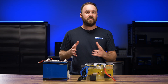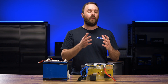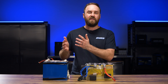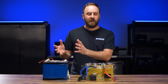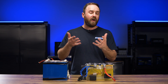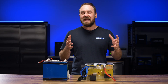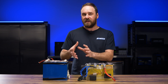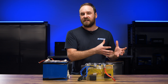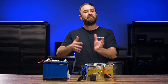Grade B batteries might come from the same batch as grade A batteries, but they don't adhere to those physical or performance specifications. So let's say it was a 100 amp hour cell that was only able to output 95 amp hours — it would then go into the grade B class. Now there's nothing wrong with a grade B battery in itself, so long as you're aware that it is a grade B battery and you're happy that it may not be the full correct specifications of the grade A equivalent. Where it gets hazy is that you see some suppliers or sellers claiming grade A secondhand cells, and that can't strictly be true because it's very unlikely that a secondhand cell would pass those strict specification requirements. It might have been grade A when manufactured, but it definitely isn't after it's done a thousand cycles.